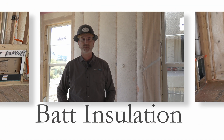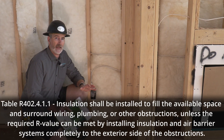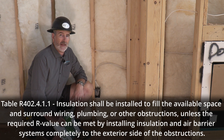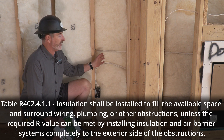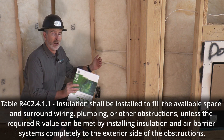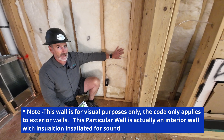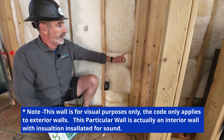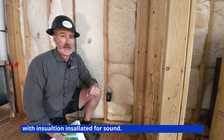We'll show you a picture of some other insulation — batt insulation that's been installed without being split around the wire and obstruction, so you can see the difference between the two. In this wall, the insulation needs to be physically split by hand around the obstructions in the cavity. You can see that the wiring in this cavity is actually compressing this batt, and therefore this batt is not reaching its rated R-value and is not meeting the intent of the code.